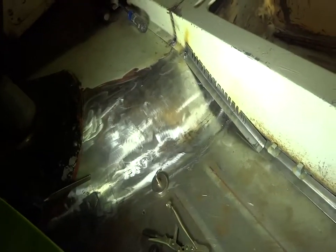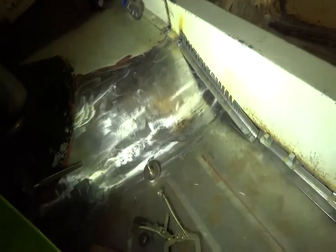As you can see, I'm starting to make the piece of metal for the seat base flange. I'm taking a piece of angle and cutting a bunch of slits in it. Let me get around here and show you a little bit more close-up what I'm about to do — I'm going to shape the metal to fit the transmission hump.